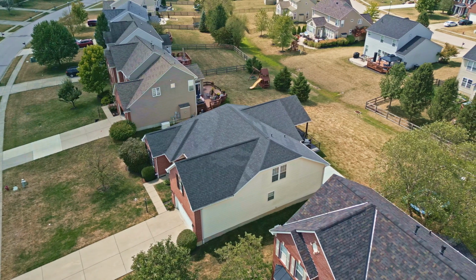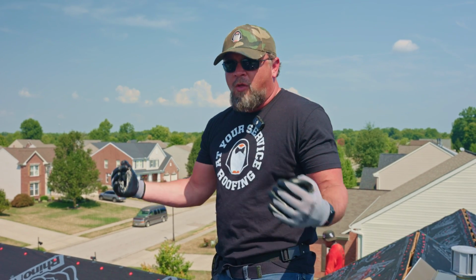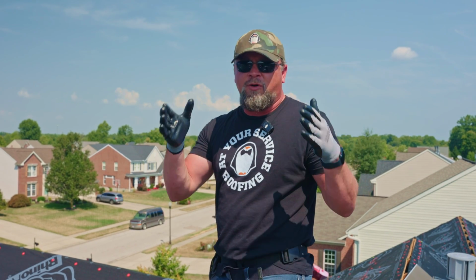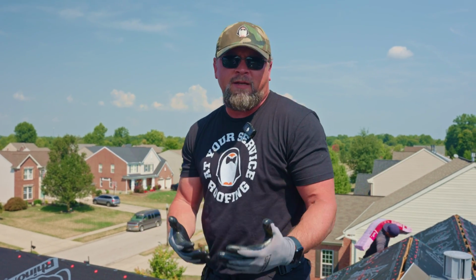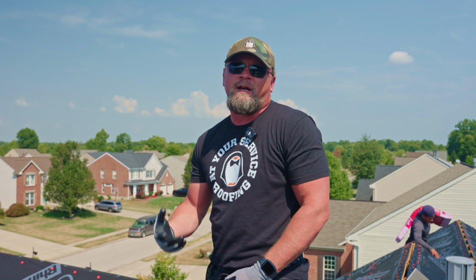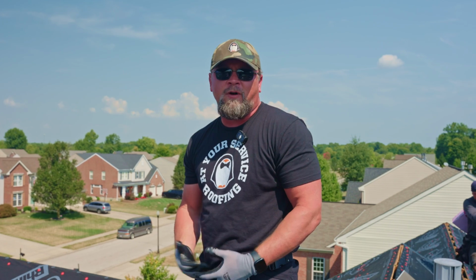So those roofs have less ridge, and there are homes that are built where all of the hips come up and the ridge on the home might only be 10 feet wide. Well, then we can only put in a 10-foot ridge vent. That's not going to provide enough exhaust ventilation. So that's a time when box vents would be far more applicable and would be a better idea to use at that point.